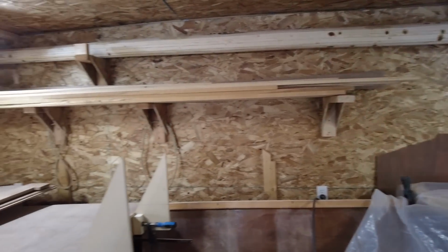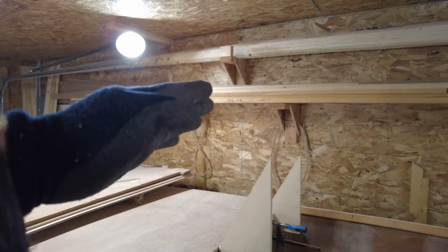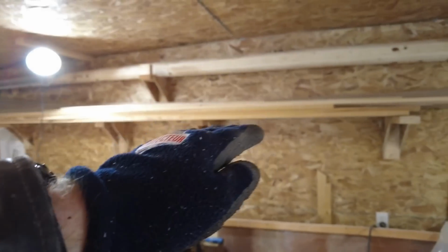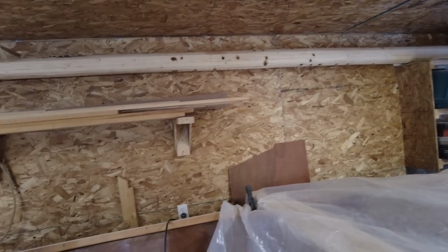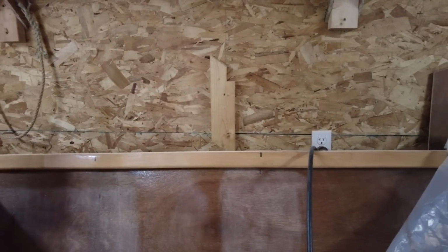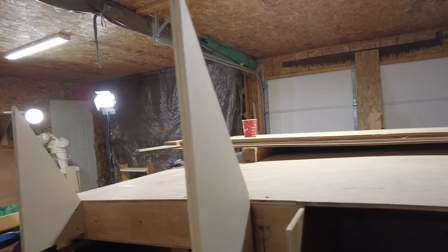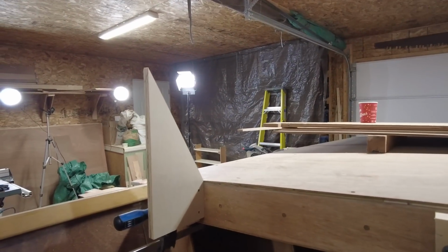And sheets of plywood come 4 feet wide. So I've made this so that by the time you get to the top of this curvature, the horizontal section will just make it to the next main bulkhead. Now, of course, 4 feet is a big span. There are 2 ring frames in between the bulkhead and this bulkhead, so there's plenty of support. Anyway, these 4 ought to do it. I should be able to secure the aft bulkhead against them. Now, time to get on with that.